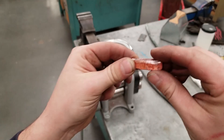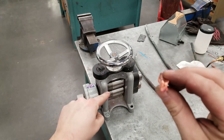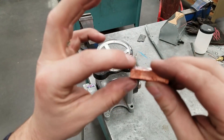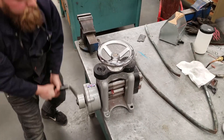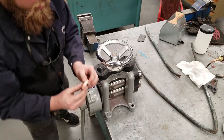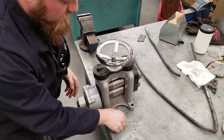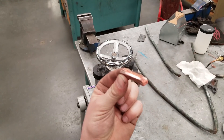It's slowly getting stretched out a little bit thinner on both sides. I'm putting it through those sections and you're seeing some grooves start — those are all going to get worked out eventually, but it's slowly getting longer and longer. This is just a temporary setup here, I don't have a permanent place to bolt it down. Starting to get a little bit hard to push through, so I'm going to anneal it once more.